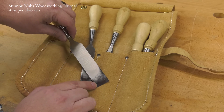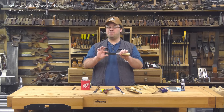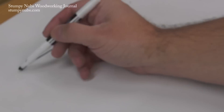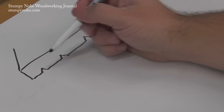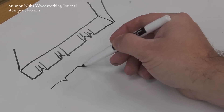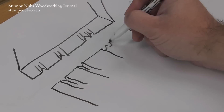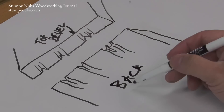This leads us to two important questions. First, does the back have to be perfectly shiny and polished like a mirror as well as flat? And second, how much of the back has to be flat? Let's start with the shiny part. The whole point of polishing is to remove the deep scratches that create a serrated edge, because a serrated or toothy edge won't cut as well, won't leave as fine a surface behind, and won't last as long between sharpenings. It doesn't matter if those scratches are on the front beveled side or on the back — if they touch the edge where those two planes meet, the effect is going to be the same.